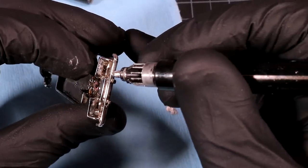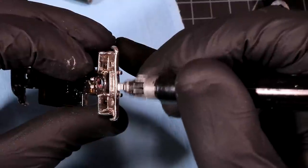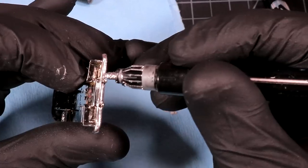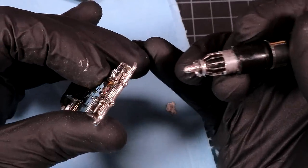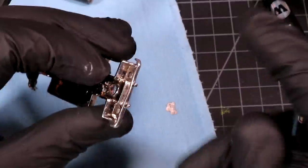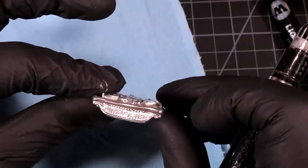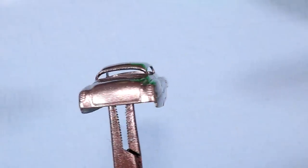This liquid chrome, I've been speed curing in my paint oven as well. It works really good. So I think everyone should get themselves a little paint oven. Two light bulbs, all you need. I have mine wired into a fancy bathroom timer switch, so you just push the button. You can pick 15 minutes, you can pick 4 hours. Actually, mine only goes to 2 hours. If this dries just like this, I'll be happy. Hell yeah, man, look at that sealer. Isn't that stuff amazing?